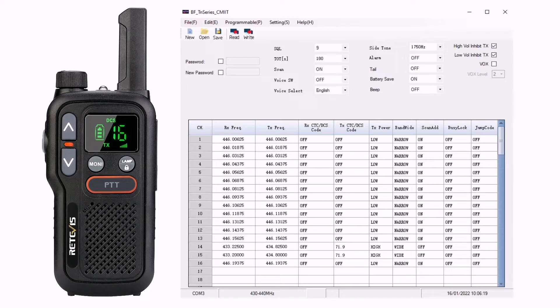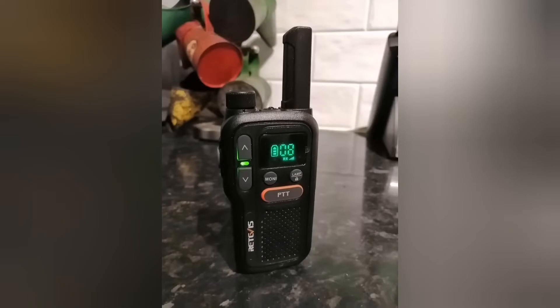This is my final CPS program — what it looked like. I decided to get rid of channels 14 and 15 of the PMR channels and put in the two local repeaters closest to me. So let's get out and do some on-air testing. I set up my SDR Play as a receiver using an outside antenna just to see what the audio quality was like. I set it up for channel 12 and also did some on-air tests to the local 70 centimetre repeaters.